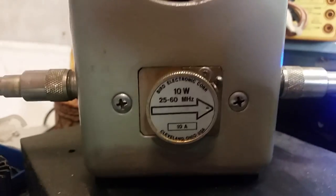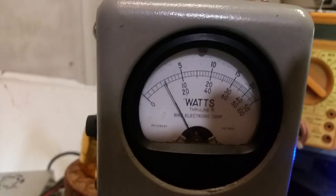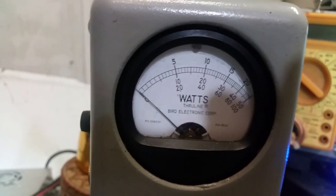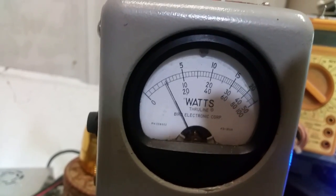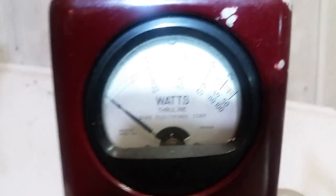So that's a 10 watt slug. I'm on my 4 watt radio, 1 watt dead key. Swinging a little bit over 4 watts, just a tad. The invert circuit is working, and that does work on SSB as well, but this is not a sideband box. This is a class C AM box. He did not request an SSB delay, but if he ever wanted one in the future, it'd be very simple to do. And like I said, the input reflect on the pass through is beautiful.